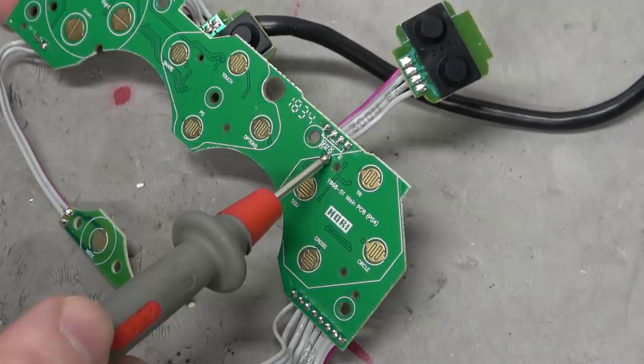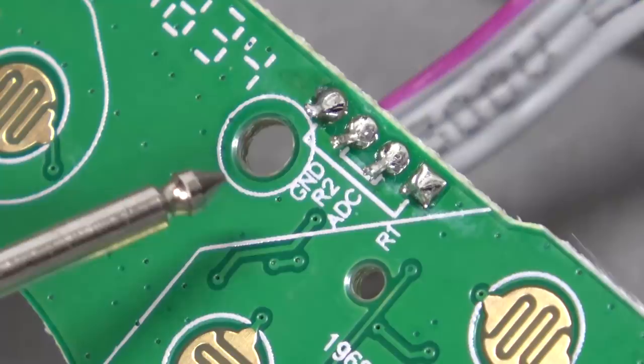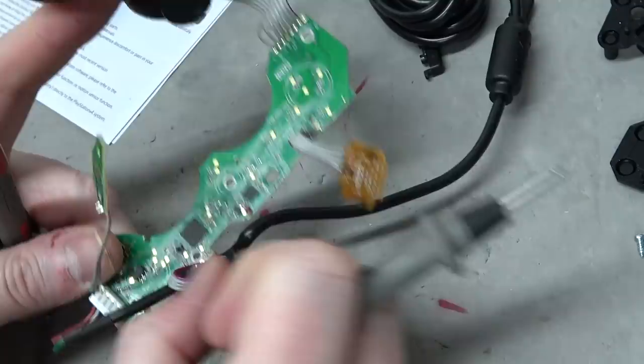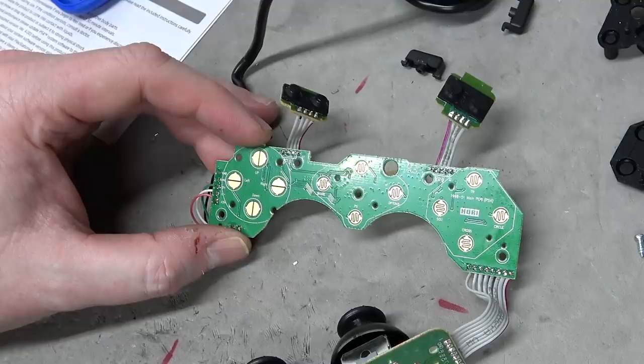I'm in love with the shape of it. ADC. I'm guessing that the ADCs on the left and right triggers are tied together — yep, they are. Microcontrollers have ADCs, analog to digital converters, but there's usually actually only one ADC because it takes up a lot of space in the die, so they multiplex it. You might have multiple pins that can take an ADC reading, but only one of those pins is actually sent to the multiplexer at a time, so they have to take turns. In this case it'll take the ADC reading from L2 and then from R2 — basically it'll take turns.